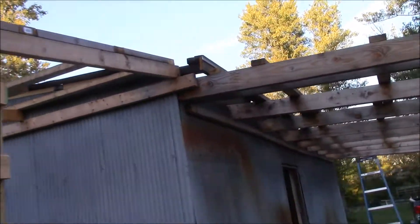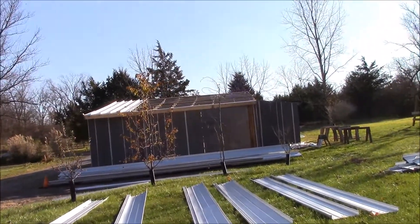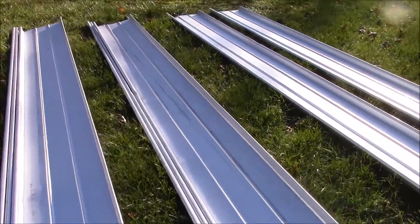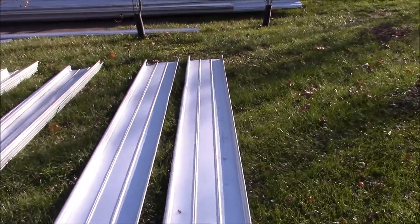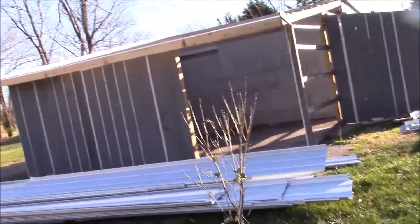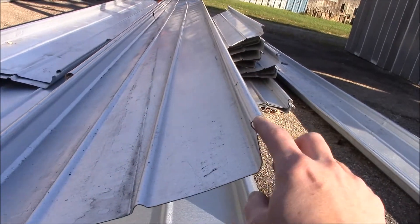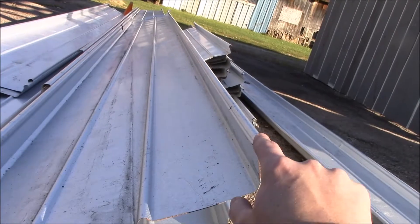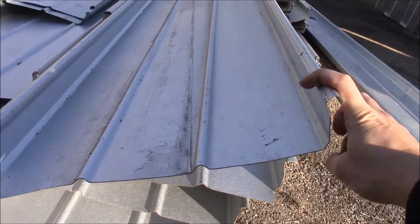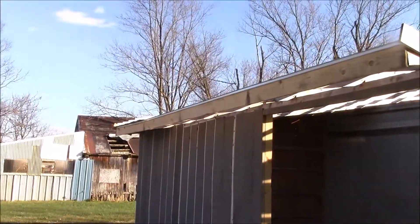Rounding out part two — the metal came in. We are reusing this metal. It's not perfect; there are dents in a few places, but it's extremely thick metal and there's no doubt it will last the rest of my life on the roof. We started putting it up — it's called zip rib metal. You have a small end and a big end: you put the small end up, there's a little clip cover that goes over it, then the big end goes over the clip, and you use a hand crimper to push it all together and seal it.